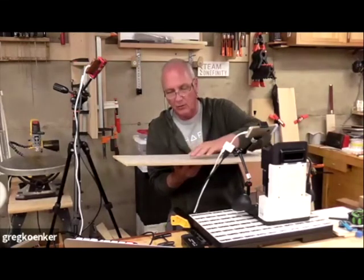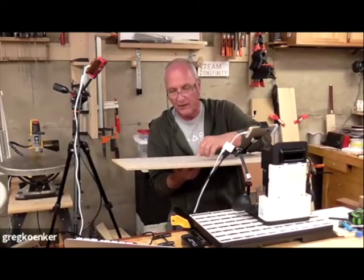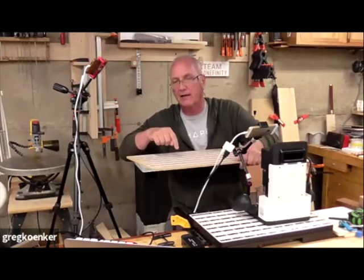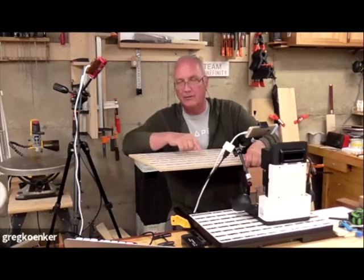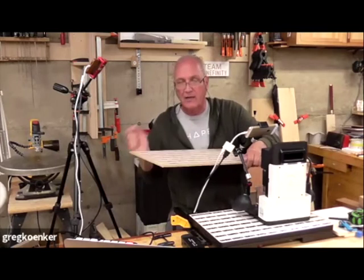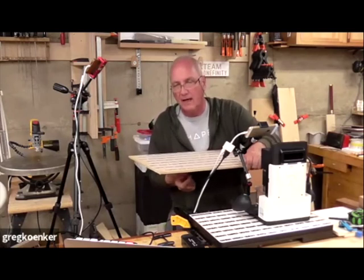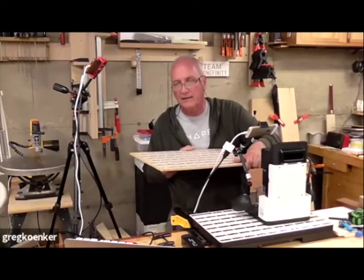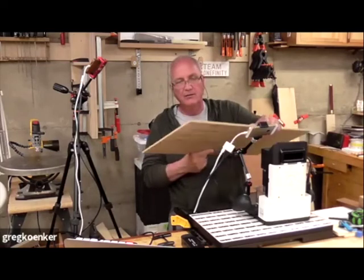So you can then move the machine over here somewhere, zero it on this surface, move it back over the hole, and tell it you want to cut a 1/4 inch deeper to compensate for the fact that there's nothing here. And you can cut into that slab. So if you cut a 1/2 inch, you're cutting a 1/4 inch into the slab. You cut 3/4, you're cutting a 1/2 inch into the slab, and so forth. So for doing some things, that works. Inlay in a slab, be it a butterfly or some kind of inlay. You can do that sort of thing.